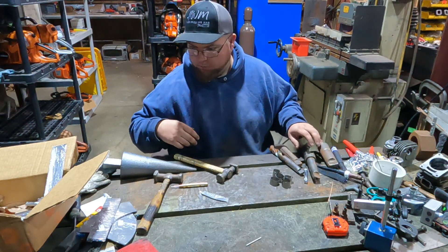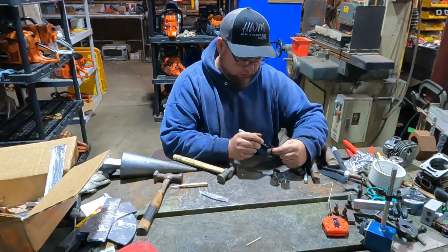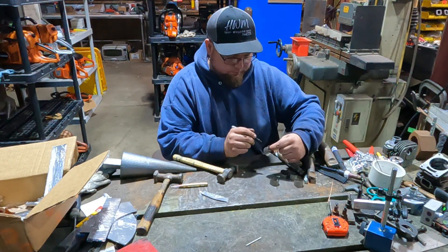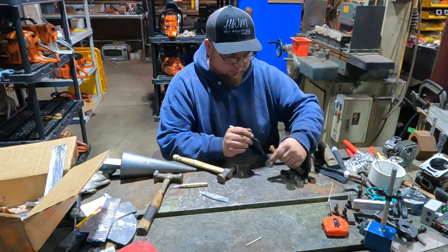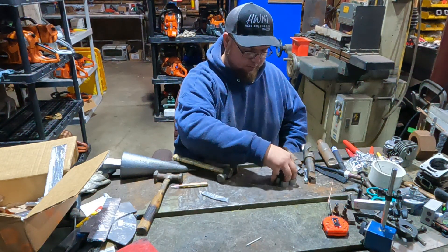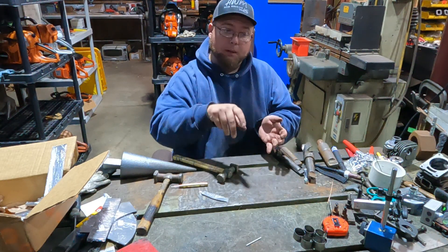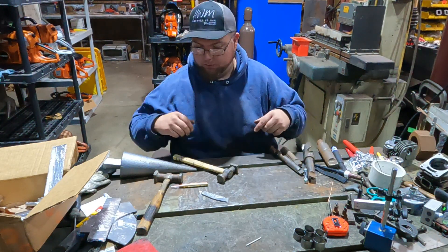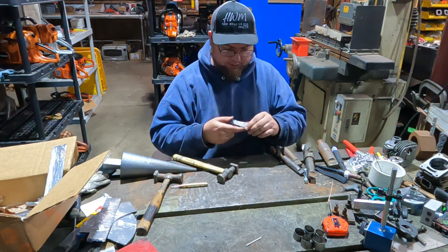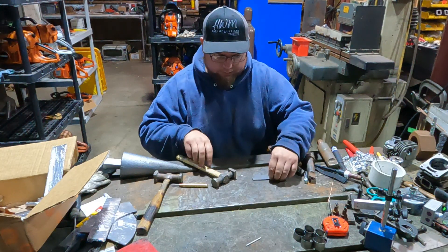These do have a little bit of a taper, which helps roll the cones. I need to number all these pieces so we don't get them confused — these will all be ones. This is one piece of the header, and it grows by a couple degrees each bend, so our header piece will be seven different cones. I'm not exactly sure which one is which until they're all formed and welded.